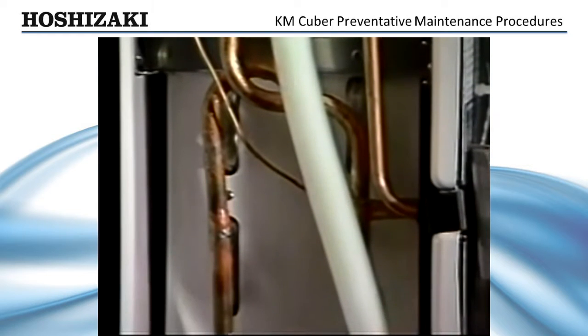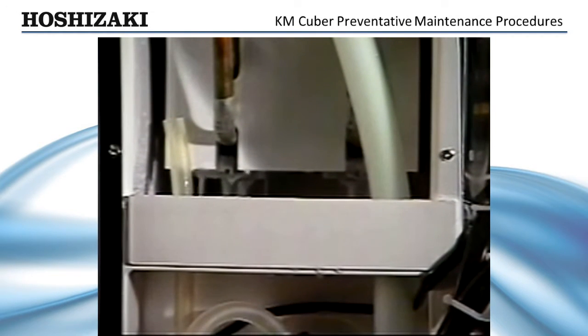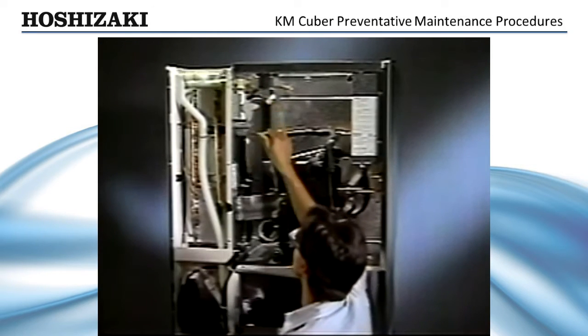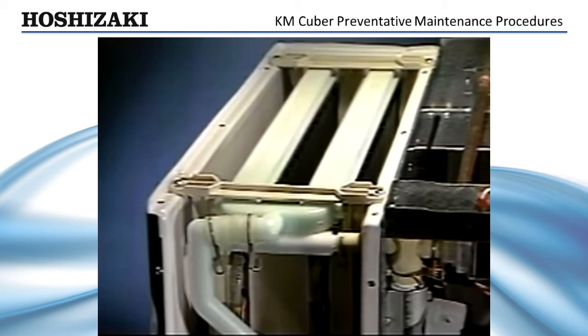Since the inside pass does not collect heavy mineral deposits, allow the cleaner to circulate through the cleaning valve for about five minutes. Then turn the cleaning valve back to the horizontal position. This allows all the cleaner to flow on the outside of the plates where more cleaning is needed.